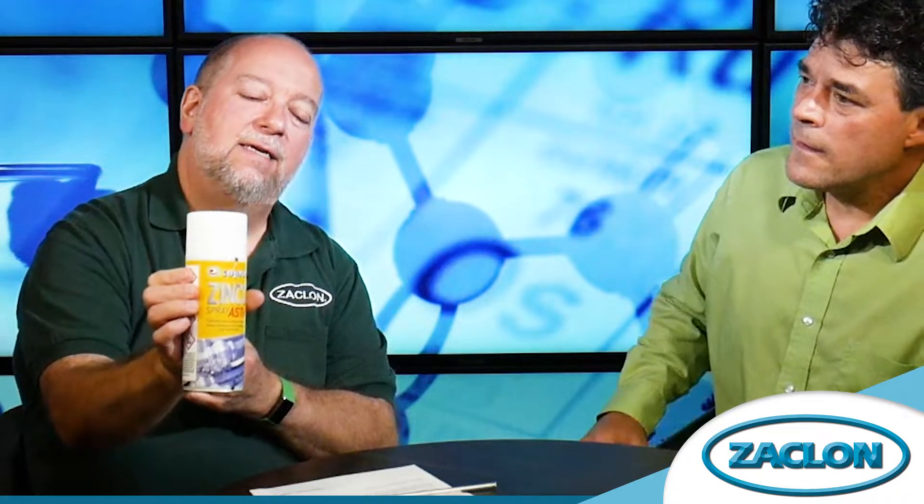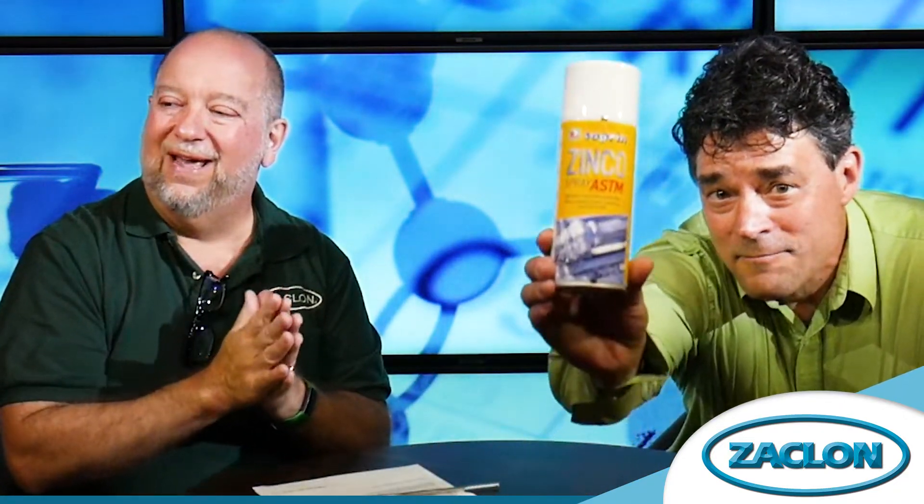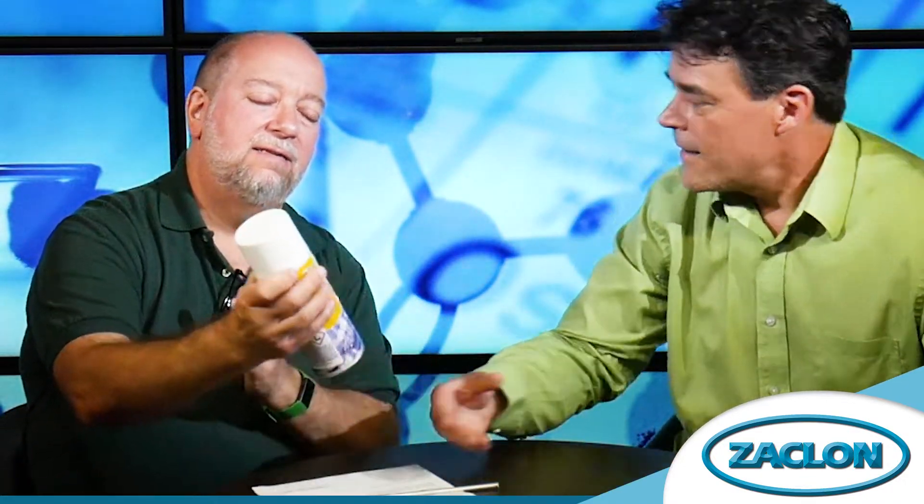What we have is this called Zinco spray, and it is a high zinc content paint that you can spray on. We have a really good nozzle so that the spray can be controlled well and it doesn't block up, which is the biggest problem for most zinc-rich paints out there. You clean the spot a little bit and maybe wire brush it to make sure things are going to stick, and then you use the paint. You'll probably have to put more than one coat on, but it dries pretty quick and you put another layer on. Because both of these have zinc in them, they will provide galvanic protection, so even if they get scratched they're still going to sacrifice themselves for the steel. So the steel won't rust as fast.